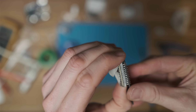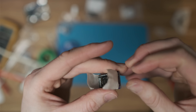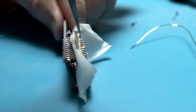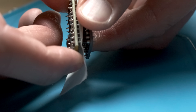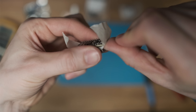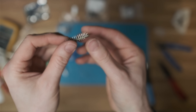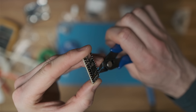Now the awful process of getting this out — if it's slightly sticky it's really hard to pry out, so you want to do this dead evenly to avoid bending the pins on one end. What tends to happen is you have to put so much force on it that it pings off. Putting a little knife in and twisting is not great for the knife, but you can keep that movement even all the way down and slowly pry it out. I'll actually show a shot where I flung it off and bent the pins quite badly — you can adjust them a little bit, but be careful and try to avoid this. When I found it, you could see it made a real mess of the legs, but luckily they bent back without snapping off, so I just straightened them out ready to reinsert.